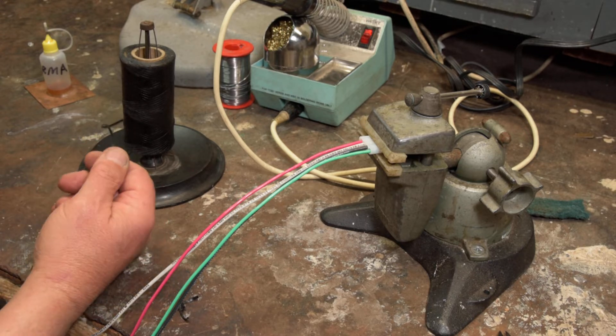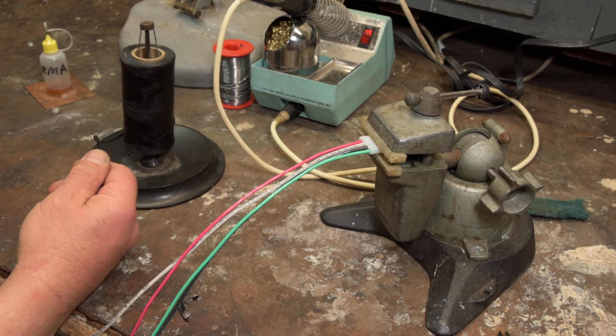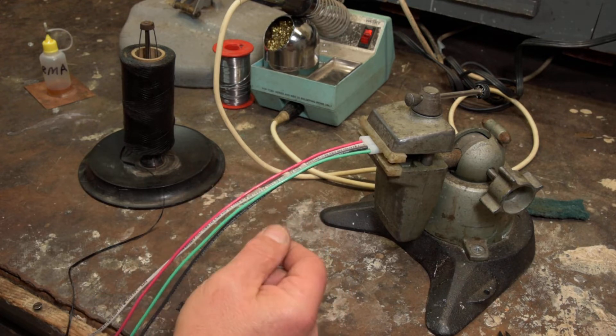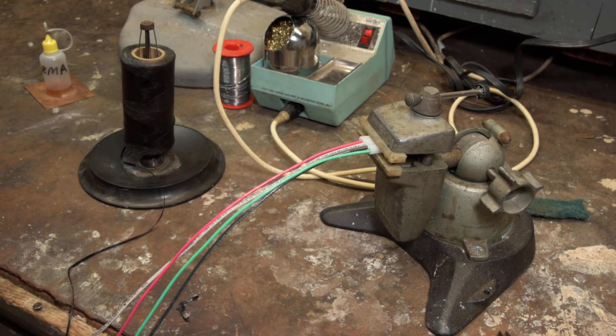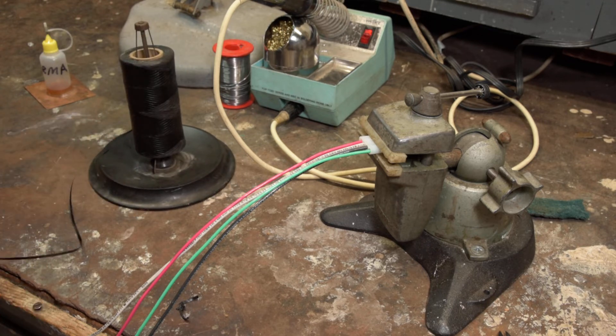The reason you use this cable lacing instead of wire ties is wire ties are very hard, and when the G-forces that fighter planes go through and the vibration, the combination of the hard wire tie and the wire would eventually cut through the insulation on the wire. So they almost exclusively use this lacing tape on the wiring harnesses. At least they did then — I haven't worked on planes in 30 years.